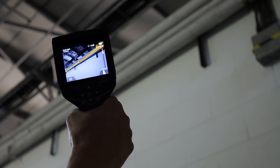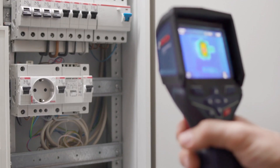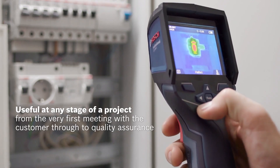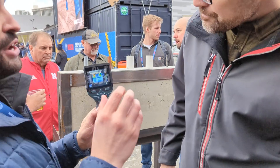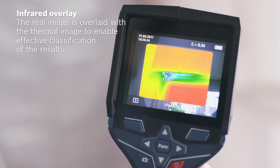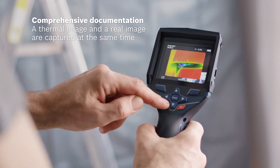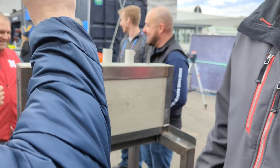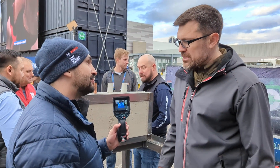So it's very easy to use — user-friendly and affordable. If you're an electrician and you're trying to find where electrical work is getting hot, that's a perfect application for electricians. If you use the picture-in-picture mode, you can use it to scan electric panels — you have small components and you have all the camera image around to know exactly what you are scanning. For HVAC, the cold detector will show you if cold air or hot air is coming.